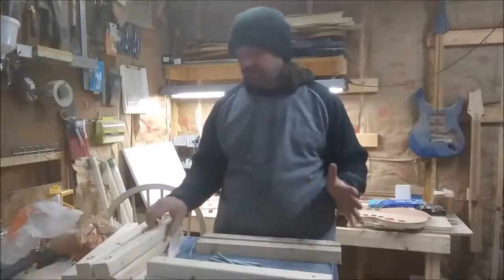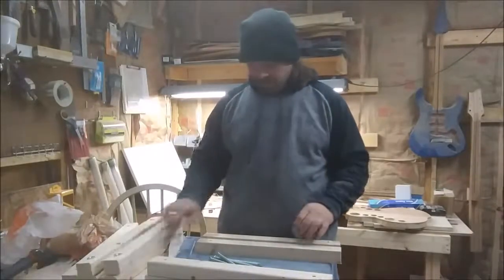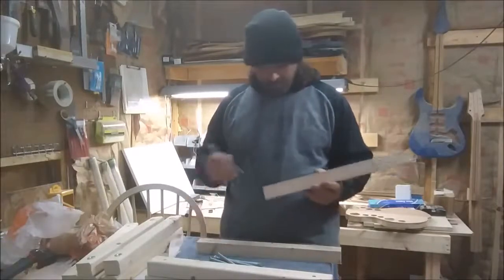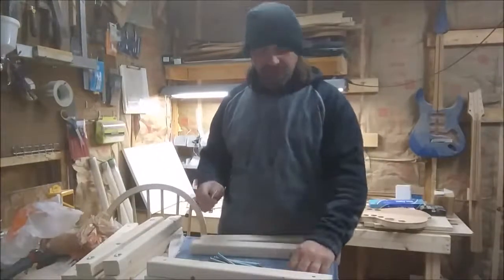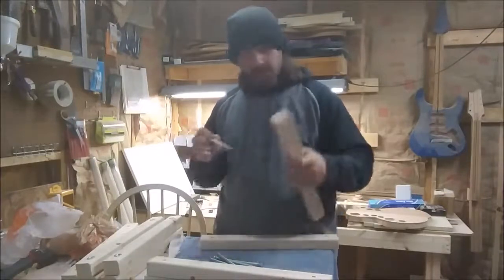We are about done with our clamps. We've got our bottom pieces with our T-nuts in it. We've got our top pieces drilled out. We drilled about the 5/16, but they were a little tight, so I went about a 1/16 bigger on that. So now we're ready to put these things together. We got flat washers to go on the clamp itself.